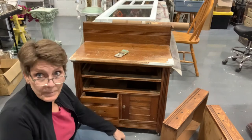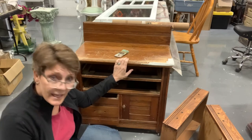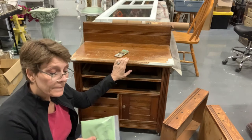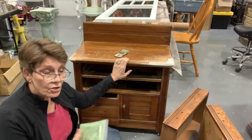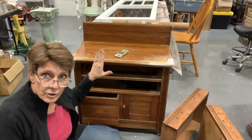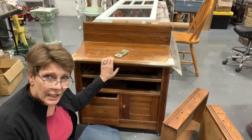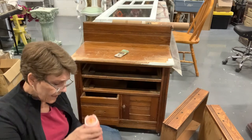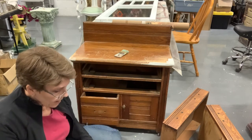The plan for this piece: I am looking at base coating it in the DIY clay-based paint. And then I am looking to do coats of 'In a Pickle,' which is a Sweet Pickens milk paint, without Bond. So without Bond, this will chip and crackle and expose the base color. I am going to do a contrasting color — I'm going to kind of hand mix it. I have Cowgirl Coral, and that could be the main color I'm going to use.